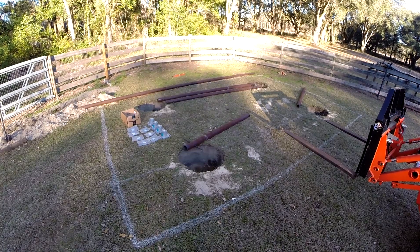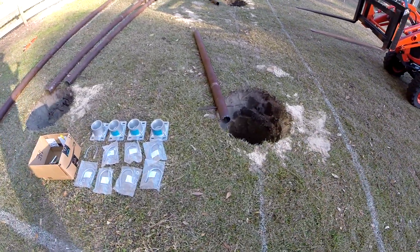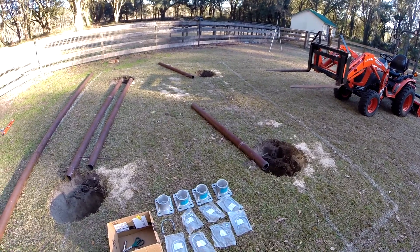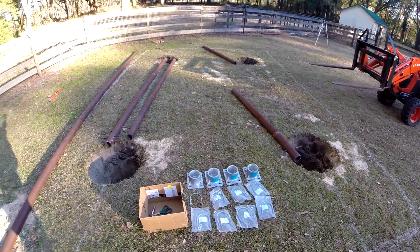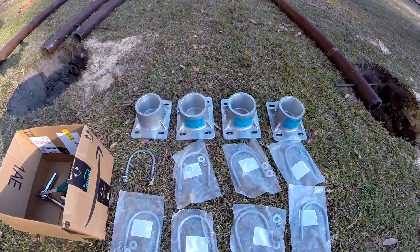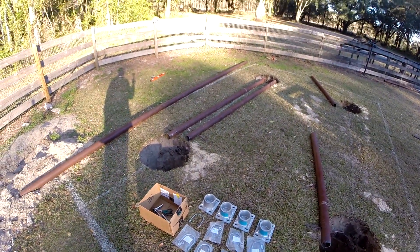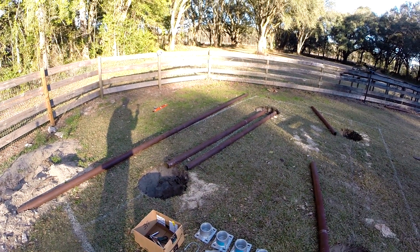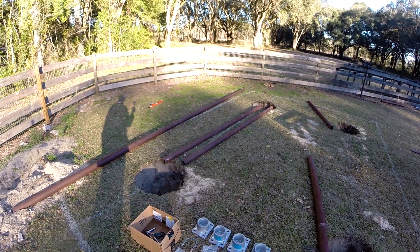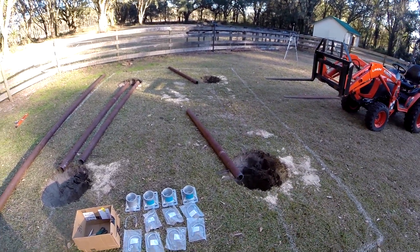I got all the pipe cut to length, went ahead and drilled it out, put some rebar in there for extra strength in the concrete. My next step is to drop these pipes into the holes, just drop them all the way down to the dirt, and then attach the top horizontal bars with these top caps — this is what I get from Iron Ridge. I'll put these on, get it all attached, do the back first — the high bar on the north side — raise it to the right height, level it out, and build scaffolding to hold it there.